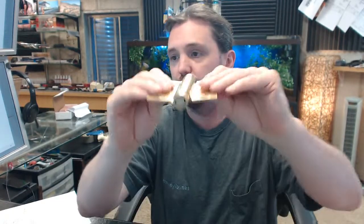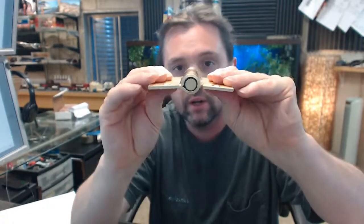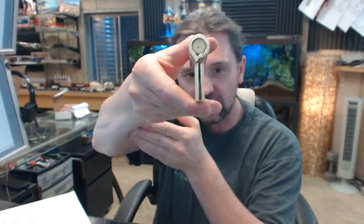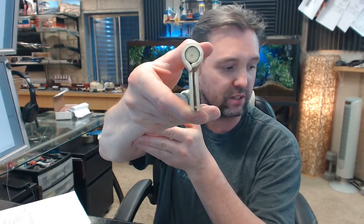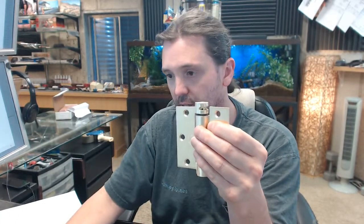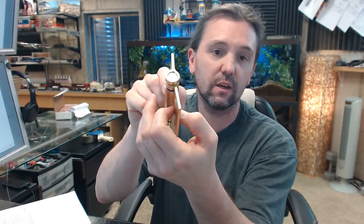This is a full mortise hinge. You can see from the swag on the hinge leaves there that when the leaves are brought parallel, they're intended to be mortised flush to the edge of the door and frame. And you can just see the thickness of the leaves there, that this is not a standard residential thickness hinge. So keep in mind that the leaf thickness on this hinge is 130 thousandths thick, 0.130, so just heavier than an eighth, versus a standard residential hinge that's about 96 thousandths, something in that range. So if your existing hinges are 1/8 of an inch or slightly larger, then you know you've got the contractor, the C quality thickness leaf. If it's less than 1/8 of an inch, and noticeably so, then you have the residential thickness.